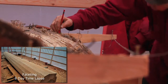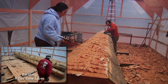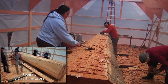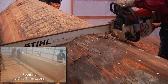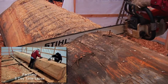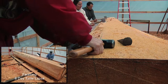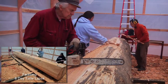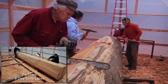I found that it actually works better just to eyeball across the string. It is best to not do all the facet lines at once to avoid confusion about which line belongs to which facet. Once the resulting lines for a particular facet are defined, the material is removed using a saw, an axe, and a planer. A chainsaw is the fastest way to cut, cutting into the log every 8 inches or so. Caution is advised not to cut too close to the final facet surface.